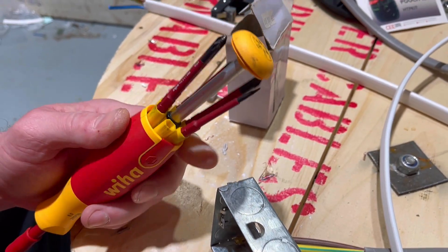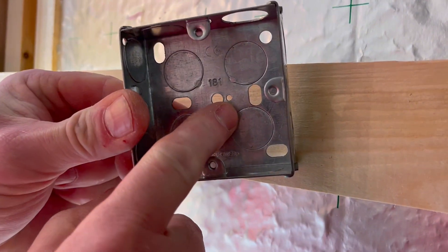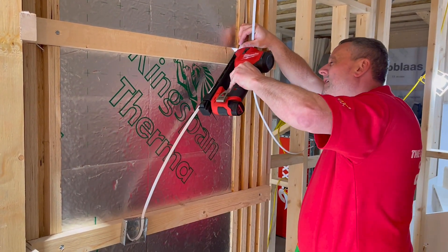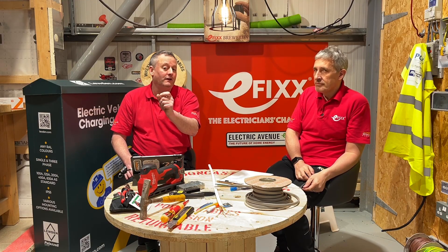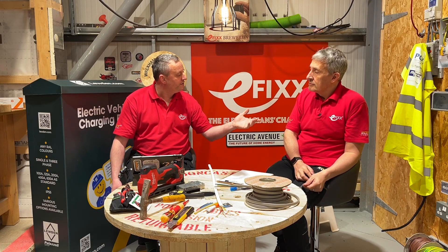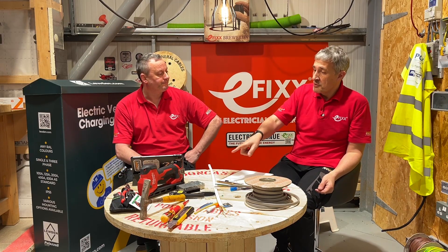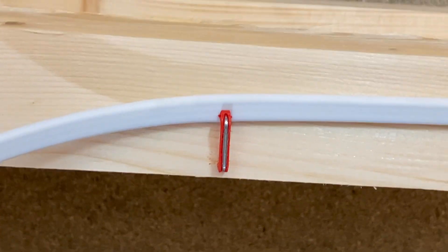There's another installation advantage. In a new build, we're going to be using this cable at Lionside Studios. When you have a little accident — maybe catching it with a screw, a clip, or a nail (the customer often does when cables are buried in the wall) — now you've got two insulated conductors side by side: the earth and the line or neutral. You've got another chance of making sure a nail doesn't damage the insulation on both of them, only damages one. Before, we had a bare earth. That can easily happen when using new tools like a Milwaukee cable stapler.